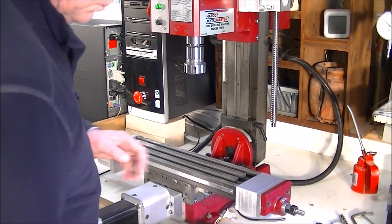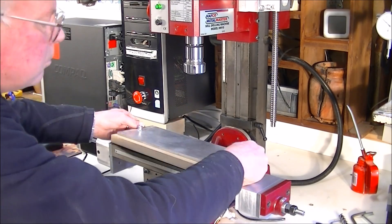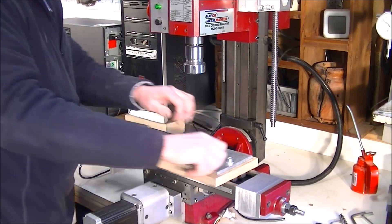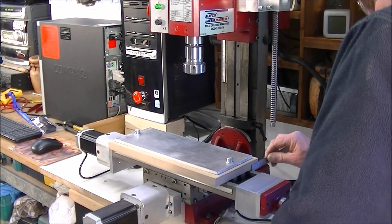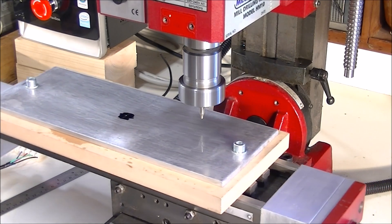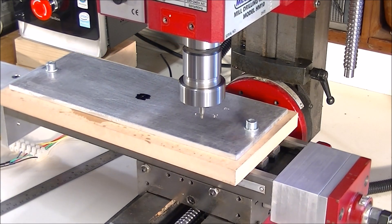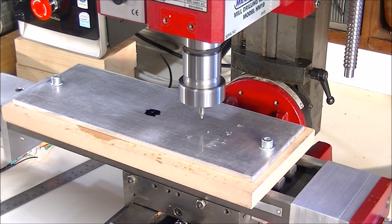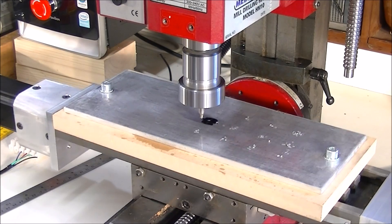What I've actually done is connected the piece of aluminium plate to some 18mm MDF to keep it up off the bed, because I'm actually going to drill all the way through — to allow the chamfer of the drill to be drilled right out. I then start the process of spotting the drill holes, because sometimes when you drill with a CNC machine into aluminium, the drill tends to wander as it starts. At this point I notice the spots aren't as deep as I thought, so I reset the zero to an additional half millimetre deeper and run the program again.